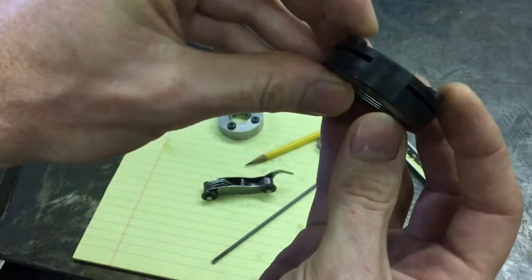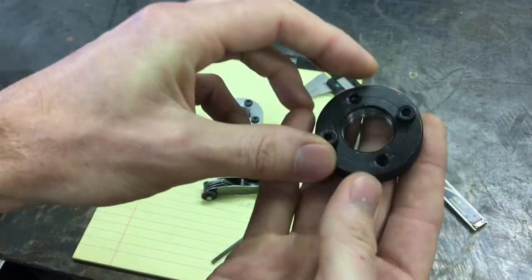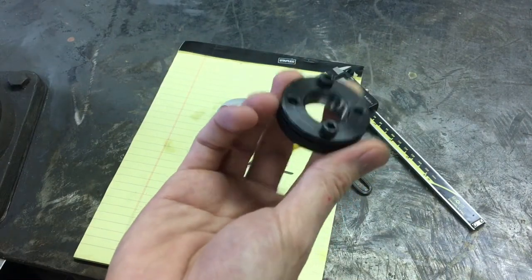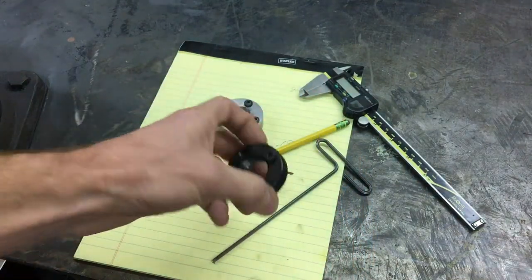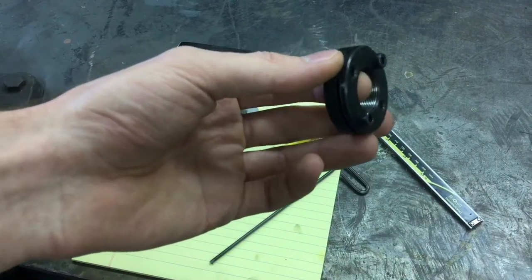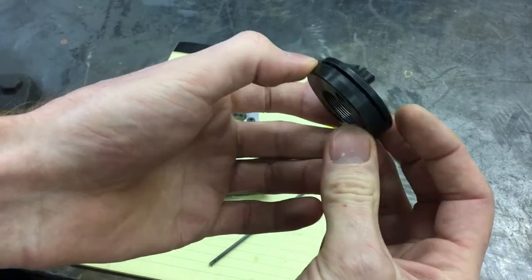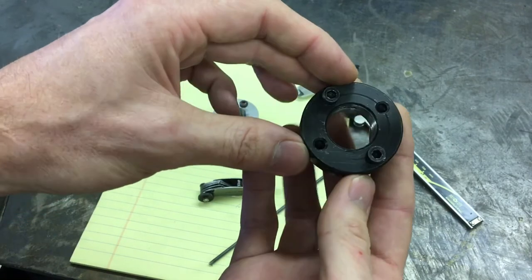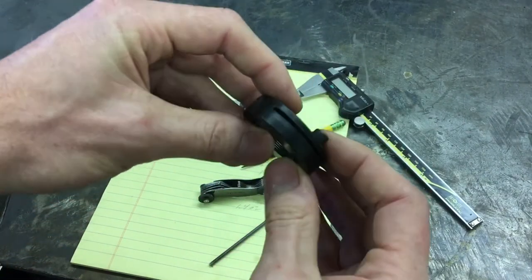These slits are completely distorted and don't allow anything to bend enough — it just sort of curls the edge over. This would work I guess, but it's a joke, because when you go to try to adjust the preload — which is a touchy thing to begin with — you can't adjust the preload and unlock it. This thing just does not work. You could crank these down all the way, have it smashed, and still get no locking action.